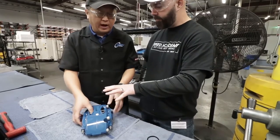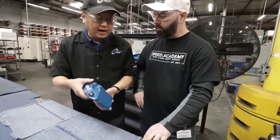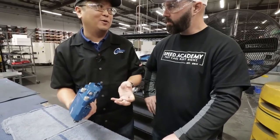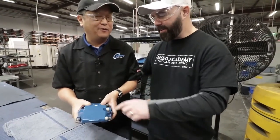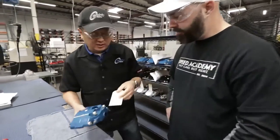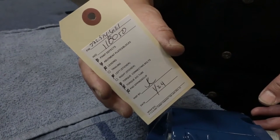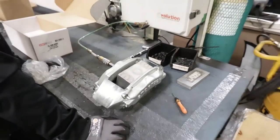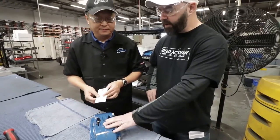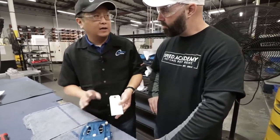So this caliper is ready to go on the car. Our philosophy here is one caliper is built by one assembly person — that person owns the process from start to finish to make sure the caliper they built won't leak once put on the vehicle. The caliper is built with a build tag and a checklist of all the important steps the assembler did while putting it together. Our next step is a testing station where we check to make sure this caliper will retain fluid and doesn't have a leak — maybe from a flaw in a seal. 100% of the calipers and brake hoses we make, if they carry hydraulic fluid, have to be tested before we release them.